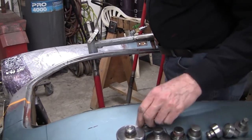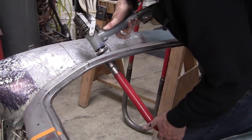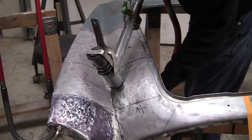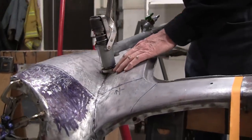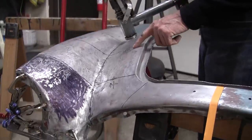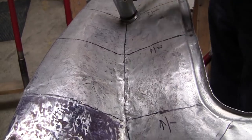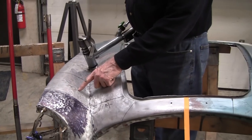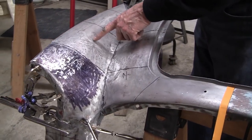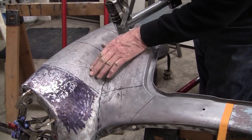And then we could choose one of these dies, maybe this one. You have to spring the frame a little bit, and then that gets in. So now you would add the air and this would all work pretty nice right in here — but you can't transition into that valley. That's the problem with a tool like this: the tooling restricts you into only certain areas. Now this might be a great tool to hammer this weld down after we grind it on the backside and flatten that out. This area here needs to be heavily flattened out. This might be a better tool, and also handwork with the dolly and a slapper. I think the English wheel will do a good job, but this might do a little bit better job because it has a stronger blow that will iron that out better.